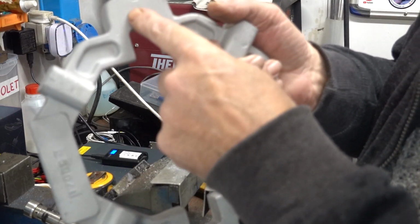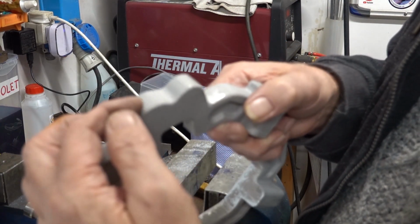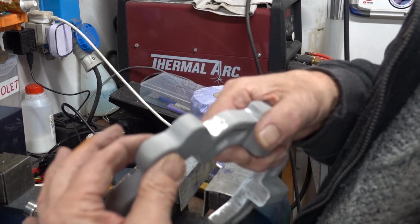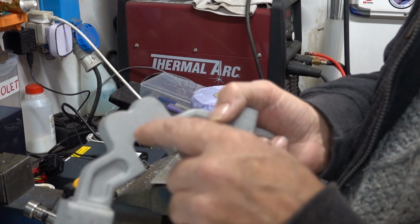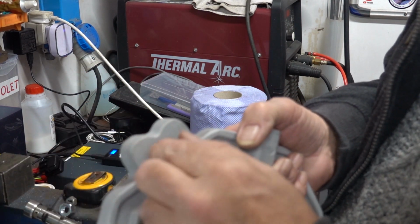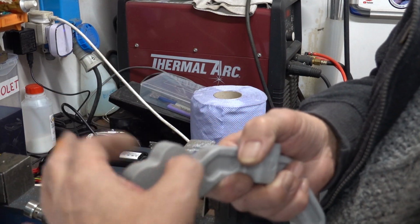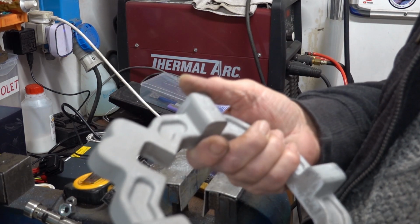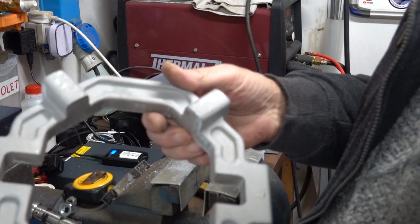And then, as I said, this one here is the hinge, and that has to have a male at the bottom, which will be just the middle bit left, and the outside edges will be taken away, and this will have the outside edges but no middle, and they'll slot together. And then a quarter steel silver pin goes through there, which has got to be either a press fit and slack in middle on the male part, or the opposite way around and tight on the male and slack on the female side, or you do what a lot of people do and they Loctite them in. I'm not a favourite of Loctiting, but apparently everybody does it, so maybe that might be the way, don't know.